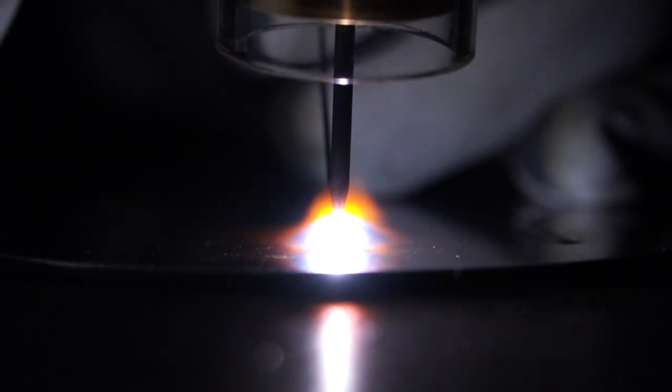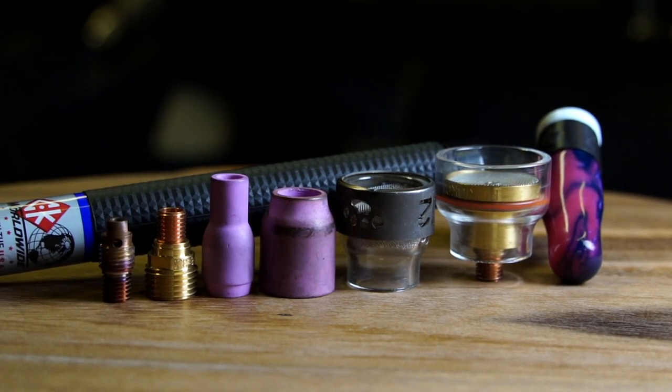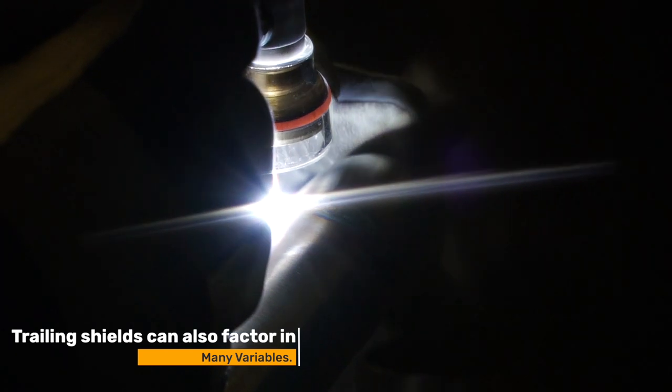Let's recap. If you want a colorful weld or even a colorless oxidation-free weld, we need to remember a few key things. A gas lens is important. Cup size plays a large factor in your weld aesthetics — the larger the cup, the more surface area the gas covers and the longer you can travel with fewer tie-ins. Cup size will also depend on what you're welding, so one size doesn't fit all. Argon cools the weld as well as protects it. Travel speed gets a lot of people when welding reactive alloys — even if you're slow and creating unnecessary heat, your argon coverage will protect the weld and it may look fine, but if it exceeds the alloy's max temperature you could be negatively impacting the structure of the material.